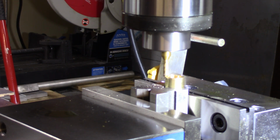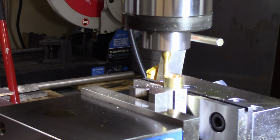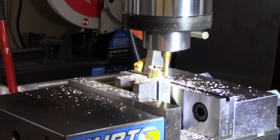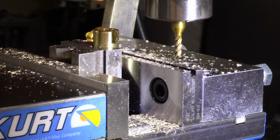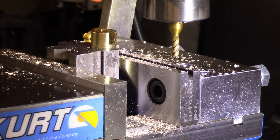I was going to cut it through there with that end mill turning backwards. That won't work good. Now, unless I've lost track, that's 400 thousandths. So I'm going to stop and see if I can't improve things here a little bit. I've come all the way down to my V-blocks. That was pretty poor planning on my part, but I've got it lifted up now, and we'll come back in here for one more cut.